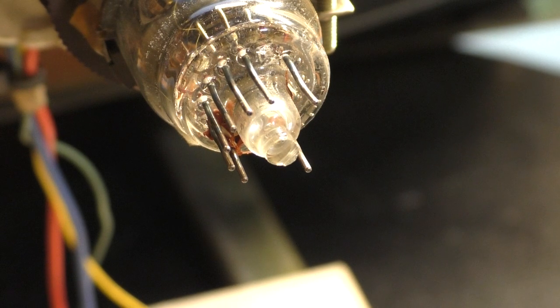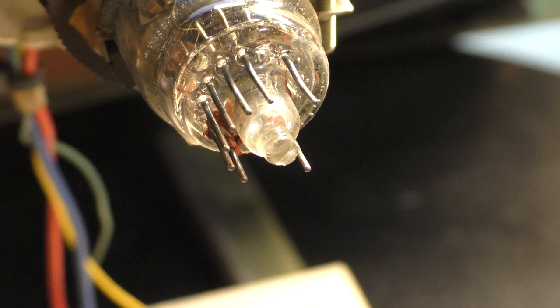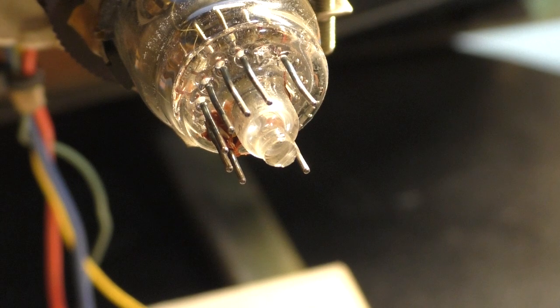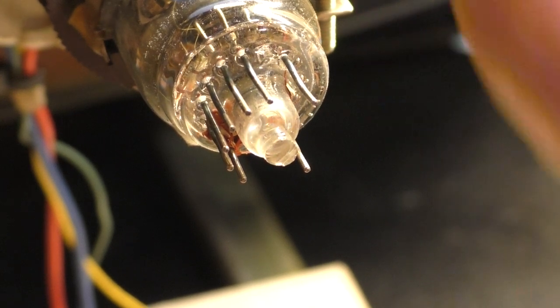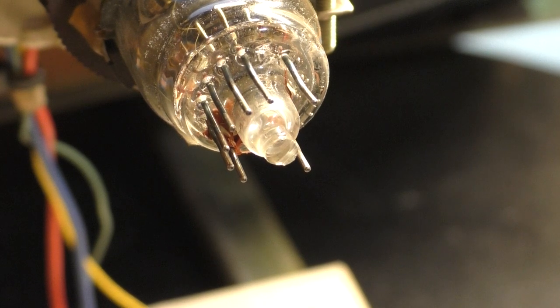Now it's not surprising. I fully expected this to happen at some point because this is my test tube that I use for all of my Wells Gardner testing. Basically, any 25-inch standard res Wells Gardner chassis, I use this tube for my testing. And all these years of on and off and on and off on the neck finally broke a pin. And it just so happens to be the heater voltage pin.